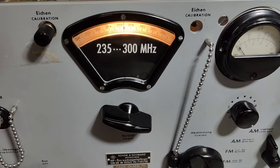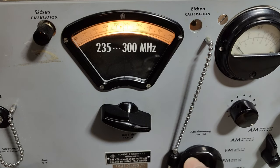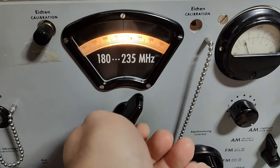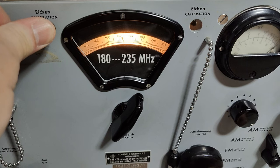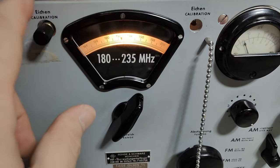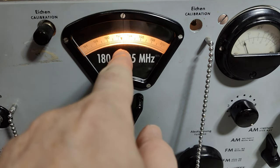We got this little red indicator here in each of the bands, and then you can tune around and hear all sorts of sounds. See there's a little problem - now it's gone. I hear all sorts of funny sounds in all of the different bands. Here again the red dot in this band - way too high, and then I should dial it down. I believe the injection here is generated by a crystal oscillator, and then it's just multiplied to exactly that point.